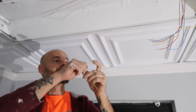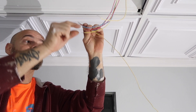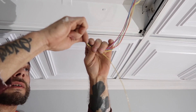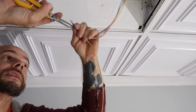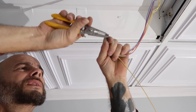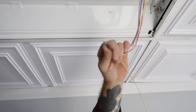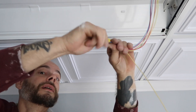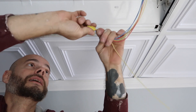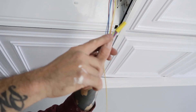This is so easy that you don't need to hire an electrician — they'd charge you probably $150 to $200 a light, and it's so simple you can do it yourself. Take all these little wires, line them up together, grab your pliers, and twist all the ends together to make sure they're tight so they don't come loose later. Twist them all together and make sure they're all cut off at the same length so the wire cap catches them better. Twist until the wire nut gets nice and tight, until you can't twist it anymore. Make sure there are no exposed wires sticking out of the end.